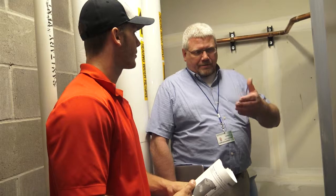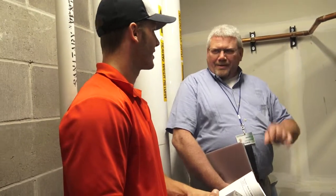No. So we have Fultons. We have a whole bunch of Fultons. I don't know if you know anything about Fultons. No, I don't. But they're a pulse boiler. Same thing. I actually went to the Fulton school. They told you right there, don't mess with the linkage, because it comes from the factory set that way. Just make the fine tuning, and they gave us a range to try to stay within.